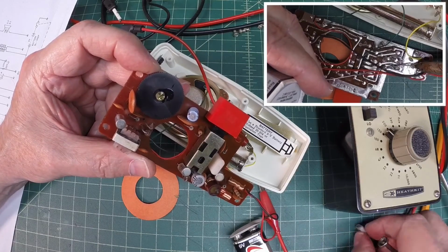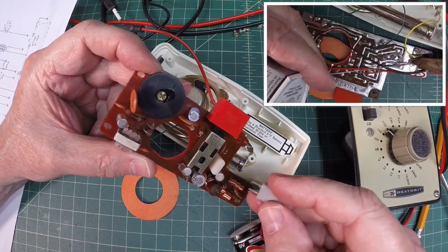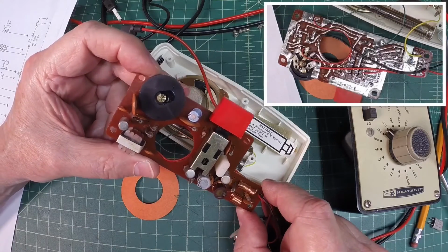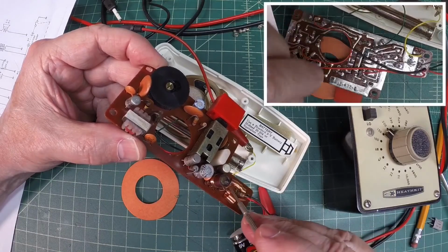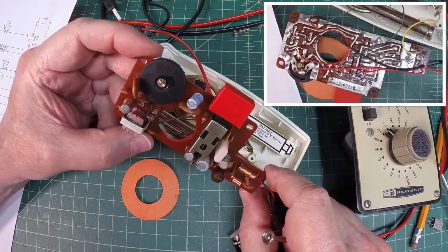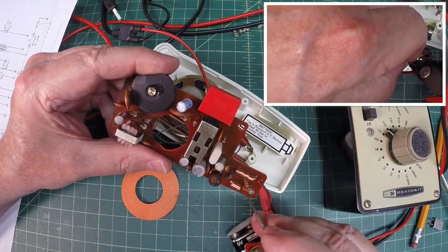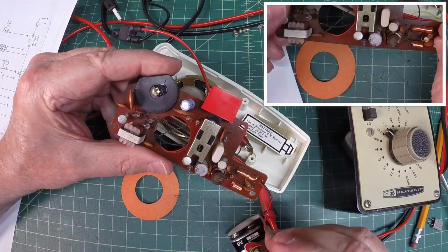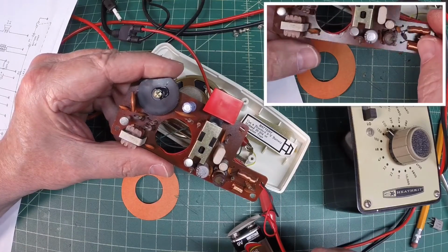I even threw another crystal in just to see across the circuit that I had, and again just doing some more troubleshooting. So I'm going to check these other resistors here really close and make sure none of them are fractured as well. But let me find another 150 ohm resistor in my component box, get this desoldered, get it put in, and we'll retest just to make certain that we're good now.